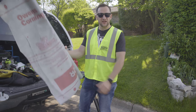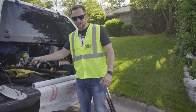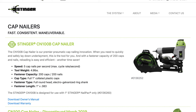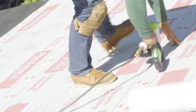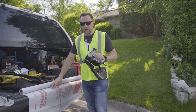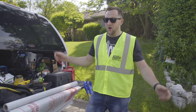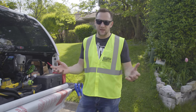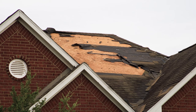But this is what synthetic felt paper does. To make this work the best, you have to use cap nailers. Stinger just sent us this gun to try — we actually already have them and have been using them for the last couple of years. The combination between cap nails and synthetic felt paper is untouchable in the industry. For years, guys have been debating me on why you can't just use staples, but if you staple it and wind or a hurricane comes in and blows up your shingles, this is also going to fly.